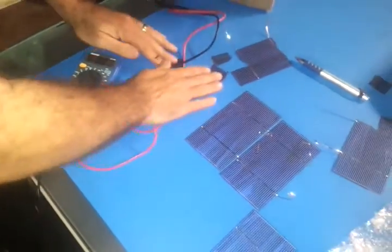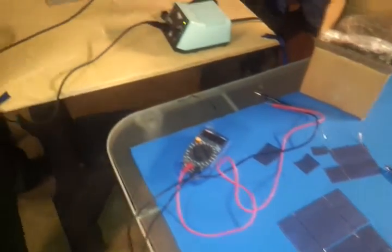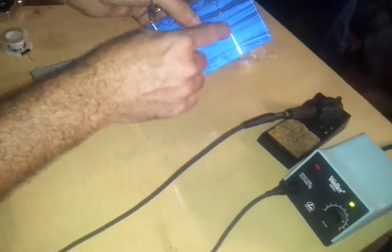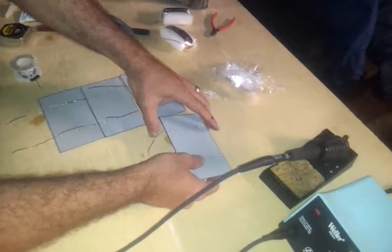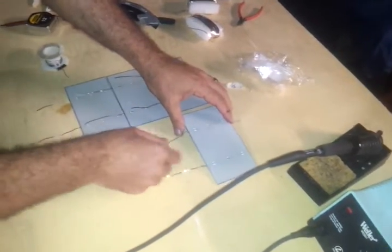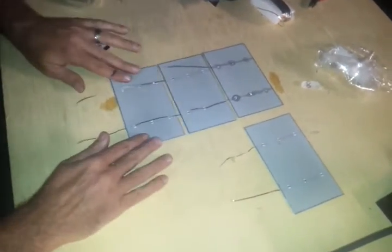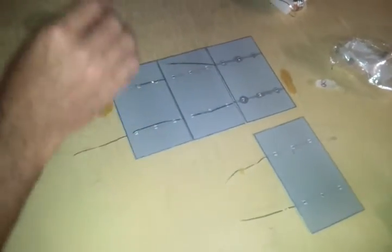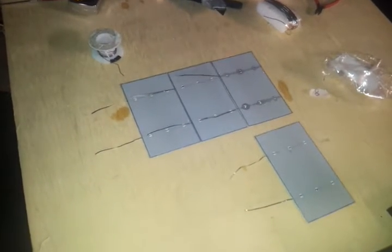You don't want to break them — they are very fragile, like a small piece of glass. What you do is take them over here and place them on their back, noting that the ones we bought were pre-tabbed, so the tabs were already on there; otherwise you'd have to solder your own tabs onto them. Then you've got your negative rails coming here, and the positive side is the back. I line the panels up like this, and then I take some packing tape and lay it down so that the panels line up.